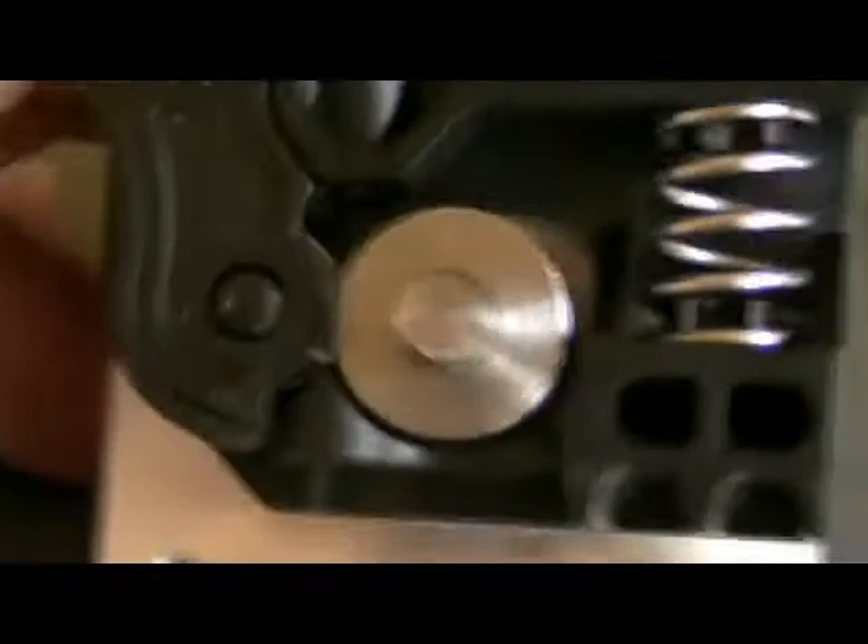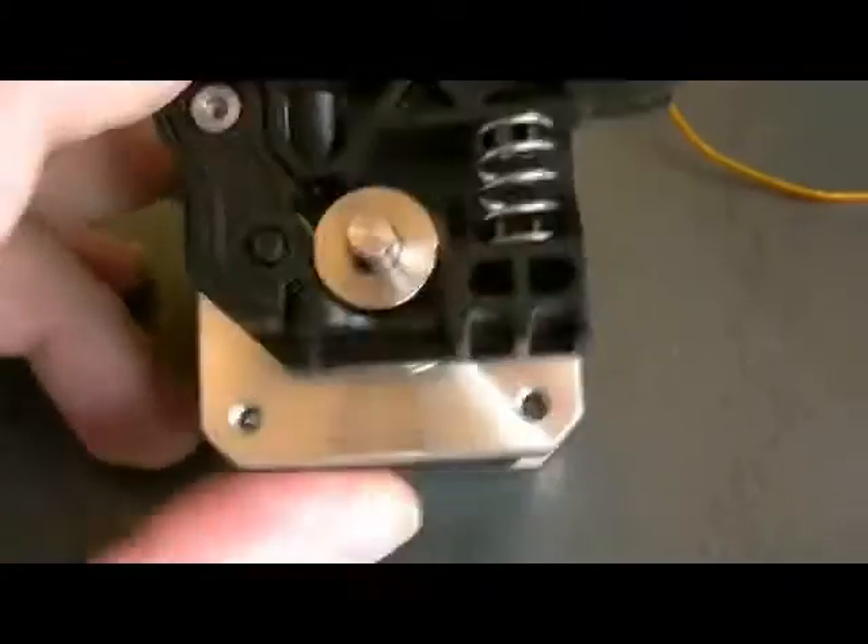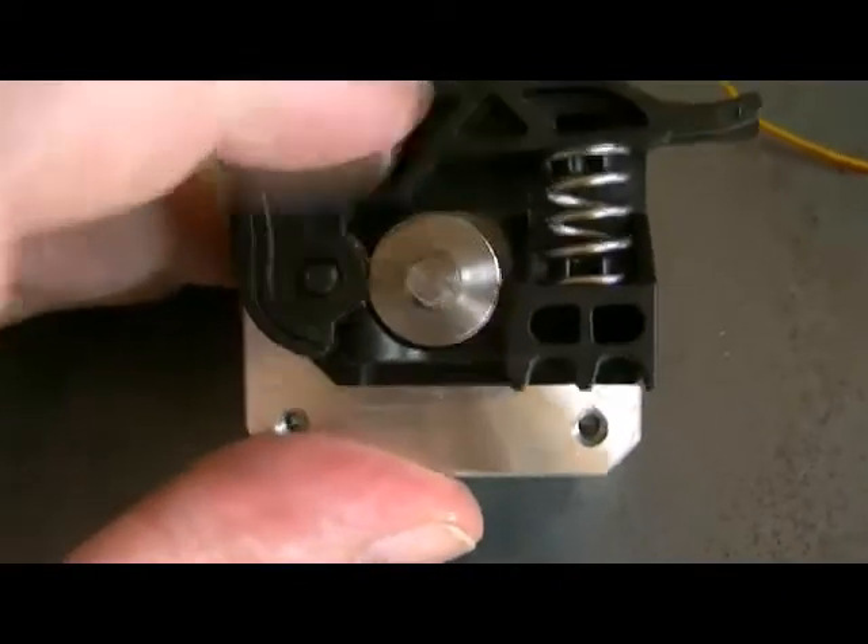The mount bar assembly is fully removed from the top of the extruder. I'm waiting for the bar assembly that MakerBot decided to send me. New nozzle, new thermal core, and new extruder — because I replaced the extruder too. I have high hopes about this big maintenance. I'm nearly convinced that the bad way the filament was being inserted could produce some kind of problem at the bottom of the nozzle mechanism.